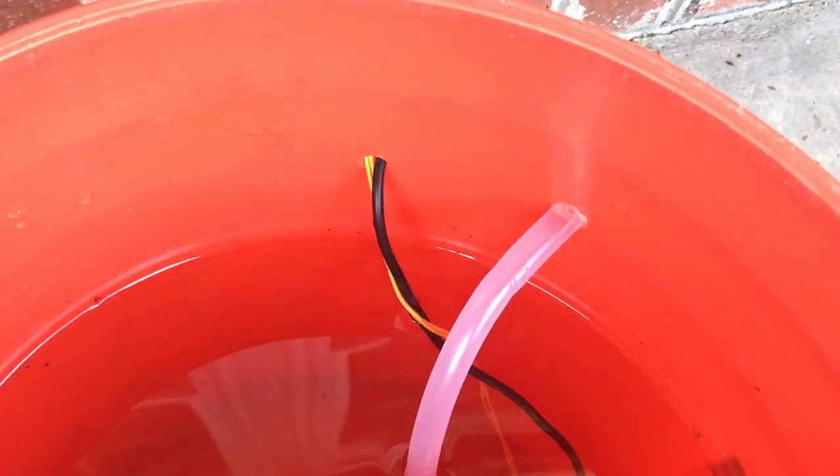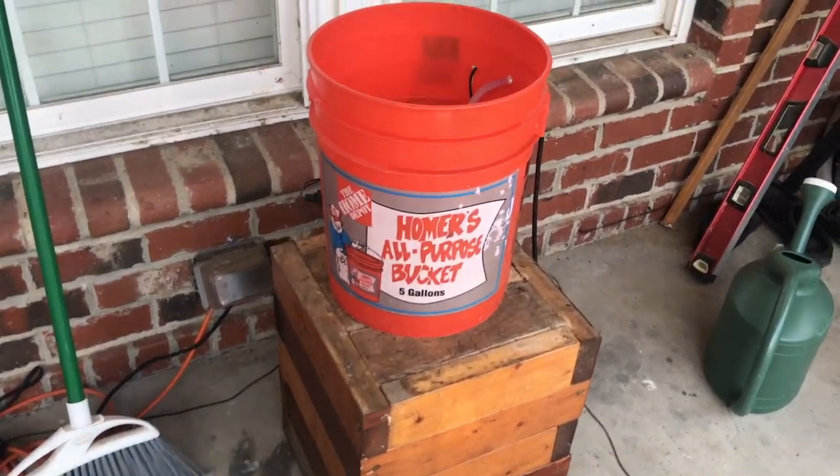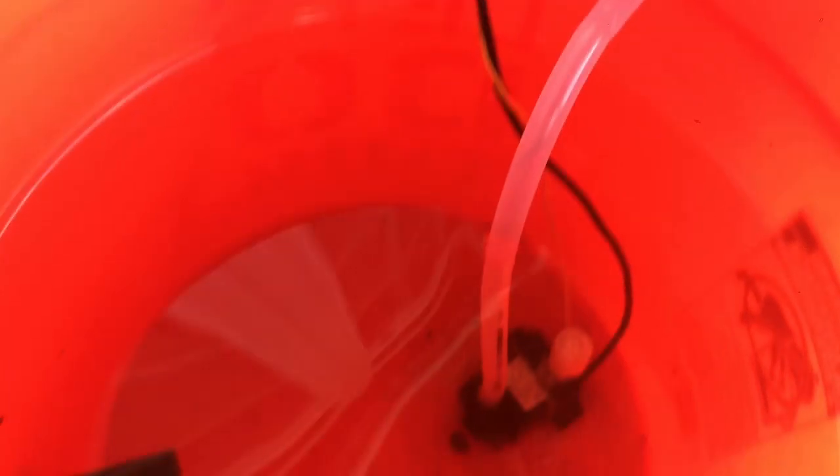So the way we're going to stop our siphoning — and just to exaggerate this a little bit — we're going to place our reservoir on top of this box. We've put our reservoir on a box, and all that did is increase the elevation to exacerbate the siphoning problem. It doesn't look like anything's happening, but water is flowing through the system right now and the pump is off.